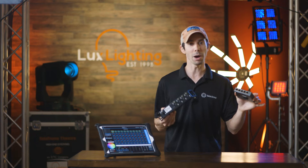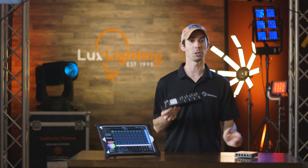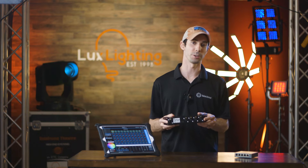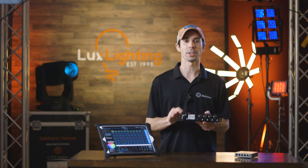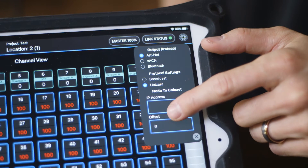You first have to go through a PoE switch, but this makes it super versatile because with one cable you can run this anywhere in your stage, powering it and sending it data. If you want to learn how to configure your DMXKing, check out this video or click the links in the description below. If you're using Artnet, make sure that your gateway's Artnet offset matches Blackout's Artnet offset.